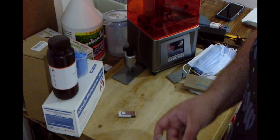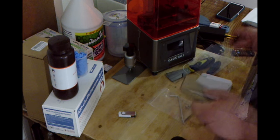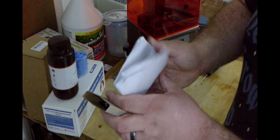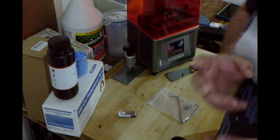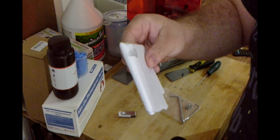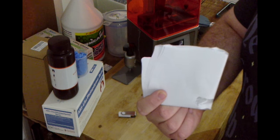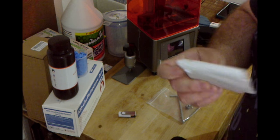We'll go ahead and get the bed on, power it out, and see how everything works. Here are paper cone filters so that you can filter your resin after a print in case you have any failed prints — there might be hardened pieces of resin in there, and that will cause future failed prints if you don't filter it out.